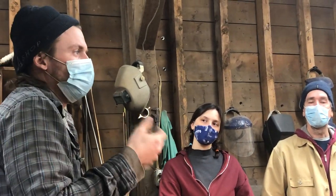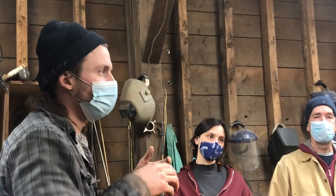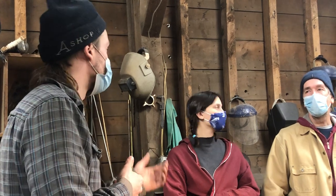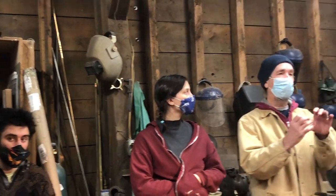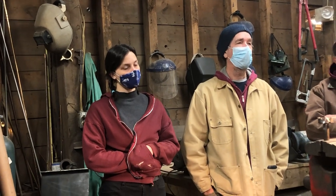There's not a lot of mass in a spade bit, so they will chatter a lot. And because there's not a lot of bearing surface either, they'll skip over the grain. They're more construction, rougher work. Yeah, if you're trying to make a hole to countersink a bolt or nut or something. It's like the mass manufactured stainless steel Forstner bit version.